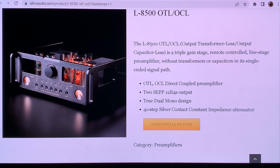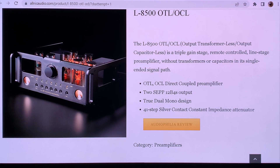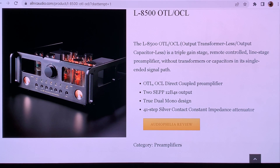It would be much better if designers consulted someone who knows the human auditory system and designed proper stepping for the attenuator. My autoformer has only 14 steps, and those 14 steps are much more useful than 40 or 60 steps used in commercial units. I'm much happier with 14 properly designed steps. This isn't something I'd hold against anyone specifically since the whole audio industry copies each other, but if you DIY it you can do much better.